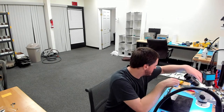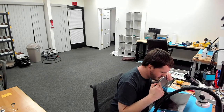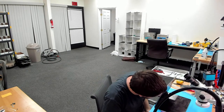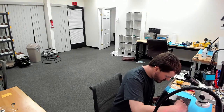Okay. I have trackpad click, 0.72, 0.49. We should be posting here. Can't tell if we have backlight yet. All right, I have keyboard backlight. These 1706s are really hard to see the backlight on, so I'm going to wait for it to flash the question mark. At a bare minimum, I know it's posting now, so that's a good sign our CPU is alive. Maybe we don't have backlight. Our backlight circuit's clean, though. Our screen might be bad. It's really hard to see.